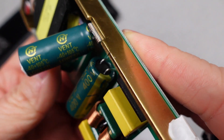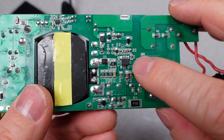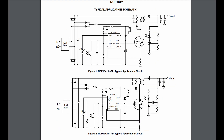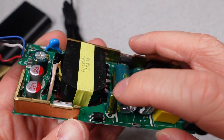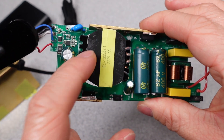I didn't find any datasheets on these. The standby voltage capacitor is also a Hirae capacitor. The primary side controller is a 1342 AMD CD, which looks pin compatible with an OnSemi chip — not a clone but functionally the same. This looks like a basic flyback converter chip, which is exactly what kind of power supply this is. The primary side MOSFET connected to this controller is an NCE65T180, a 650 volt transistor with reasonably low capacitance and not bad on-resistance. There are many support components — diodes, capacitors and resistors — making up typical switching power supply circuits, likely exactly the recommendations from the datasheet. Next up is the transformer.